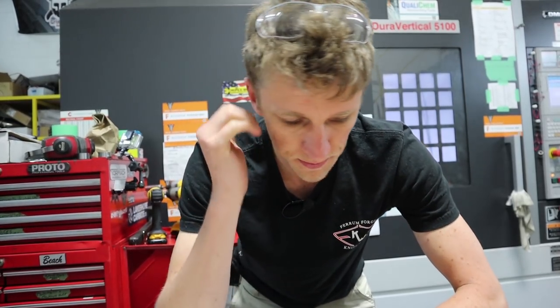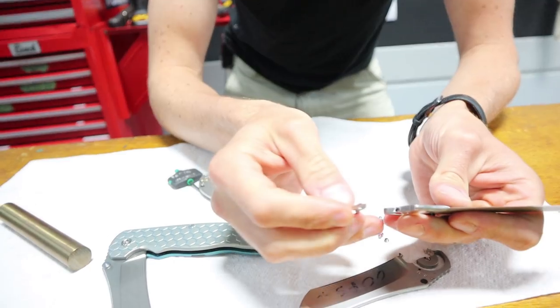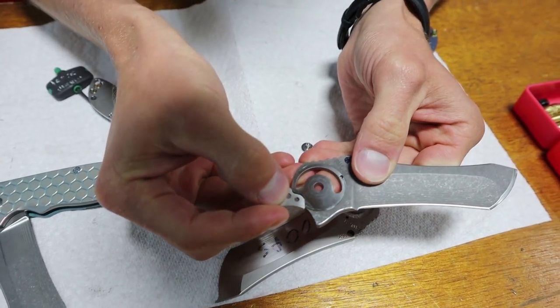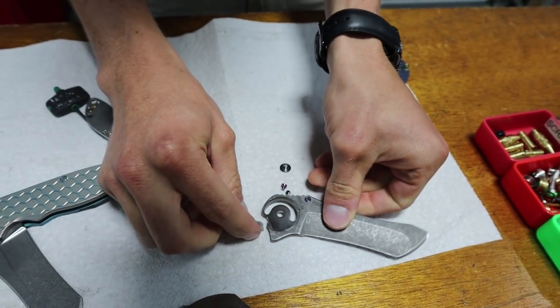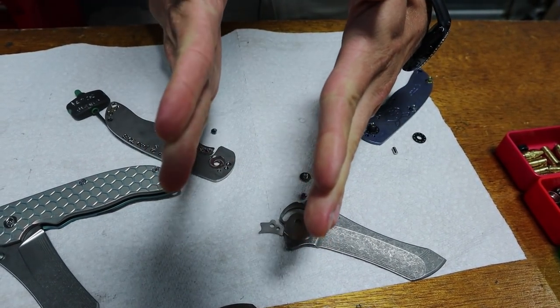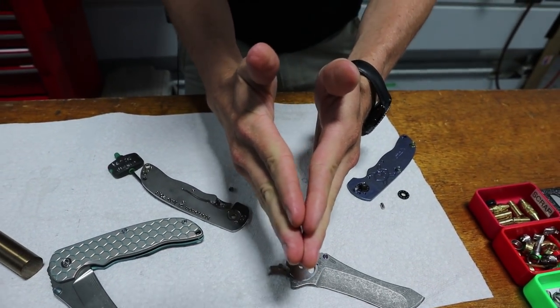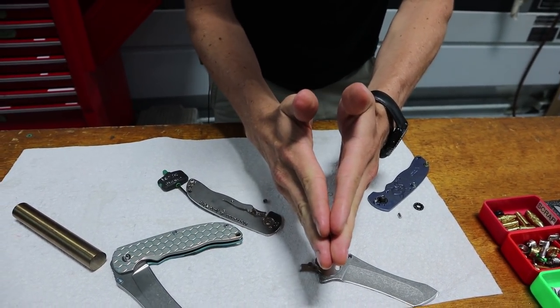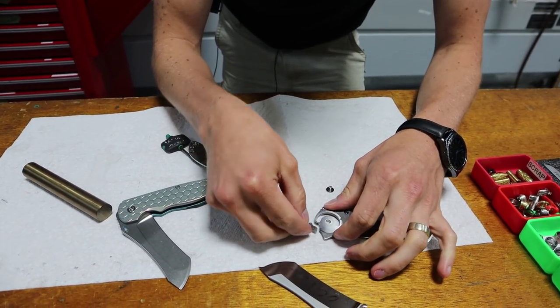And so we're trying to get the geometry just right, so when the steel insert contacts against the blade, we get the perfect angular contact. Something that's super important for a lock face, if this is your blade and this is your handle, they can't go like this. They actually have to tilt back, I forget how many degrees, but just ever so slightly. And these two happen to be almost touching.